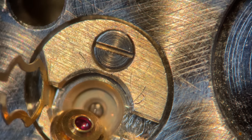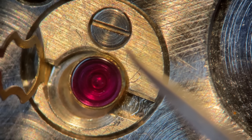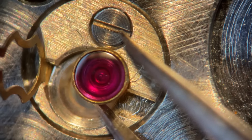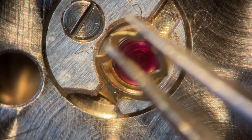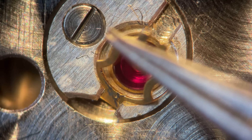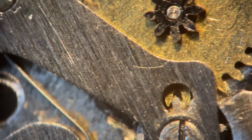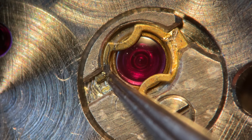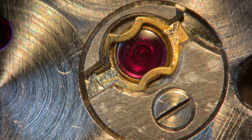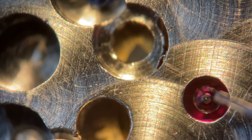This is the bottom side — I seem to have missed a little bit here, so let's gently urge this cap jewel into place, and there we go. I replace the spring back to position — it's always a little finicky, and I find it's easier to turn the whole movement around so I can pull across the spring and get it into place rather than push it. There we go, everything set in place. There are a few more jewels to oil on the bottom, so I may as well get those while I have it on the microscope.